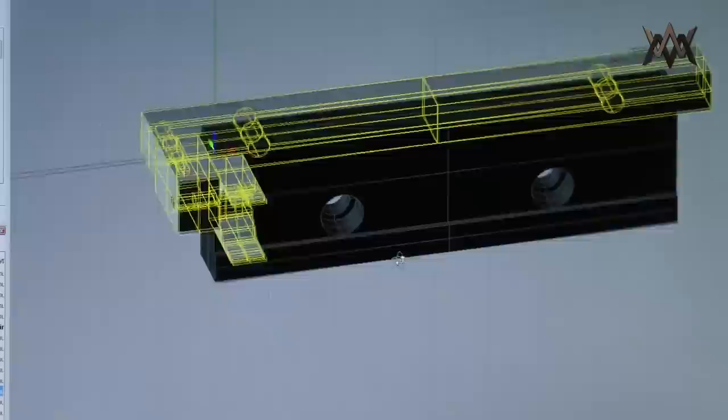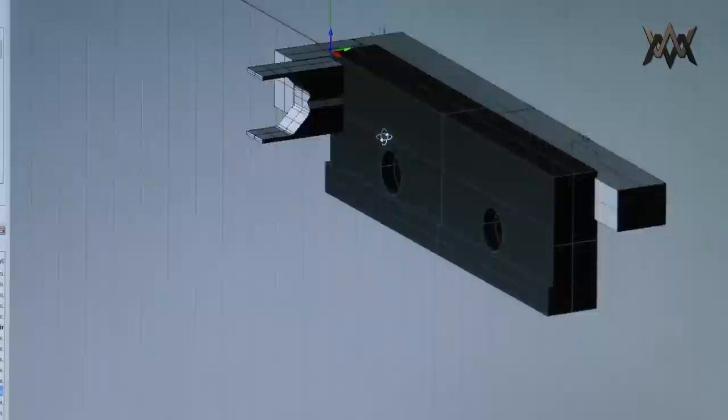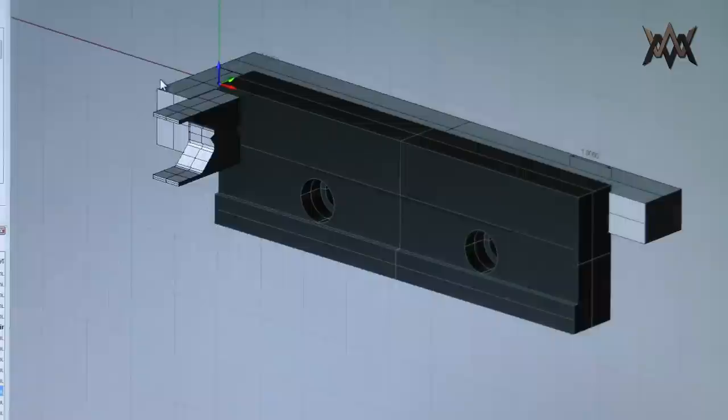And I'm going to do something else for pistol barrels here because they're so short. I might think of something different. But anyway, that's what it is. So what this will allow me to do is clamp a barrel rigidly in the vise, and then I can CNC drill the holes and run the taper reamer in there.